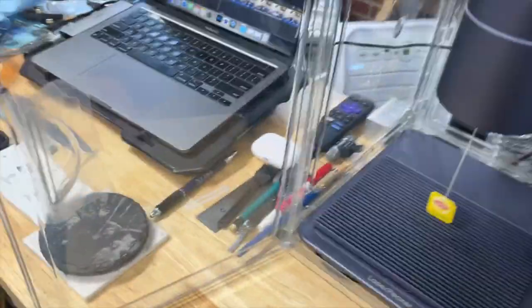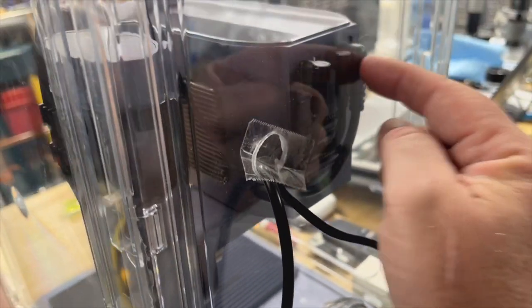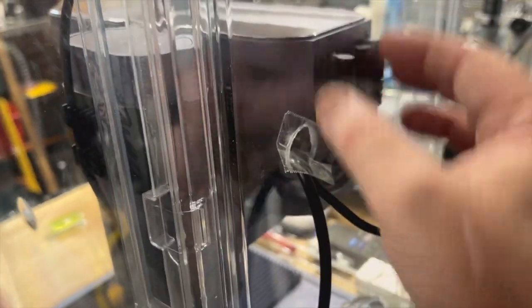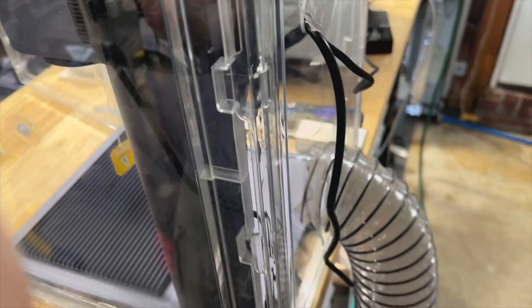You'll also have to cut one other hole to run your wires in — I have all my connections in there. You do need to use the 90-degree angle connectors because it's that tight of a fit. If you used straight connectors, you can't get them in there — or you'd have to cut a bigger hole to make space, which is also an option.